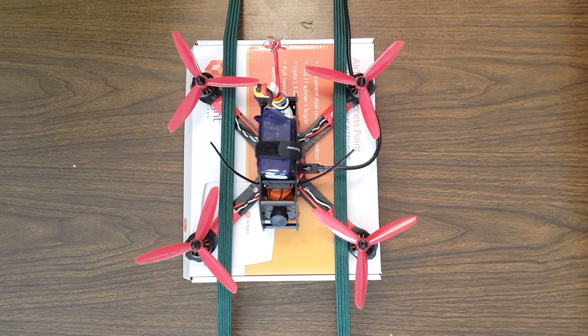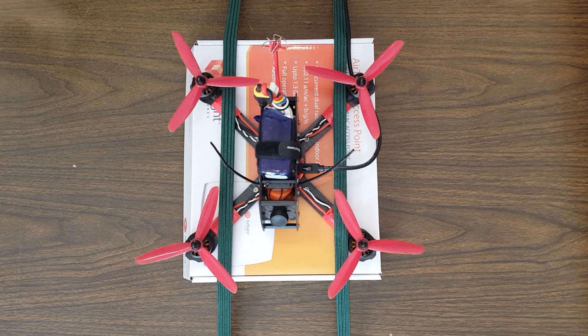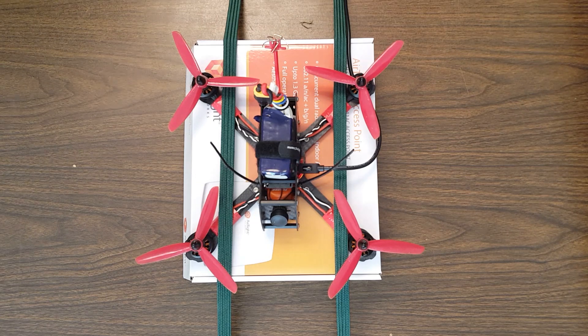So what kind of things can you do? You can play with the motor timing, you can play with the DMAG prevention, and you can play with the startup power. Frankly, I'd be really surprised if timing and DMAG were an issue here because the simplest thing the motor can do is idle, and if it can't even idle, it's hard to imagine we're getting any kind of desync or DMAG problem under such simple and non-demanding conditions. So maybe we have a bad ESC — this is a fundamental enough problem that it could be a bad ESC.